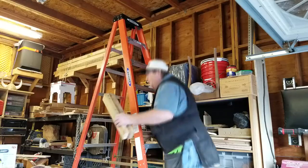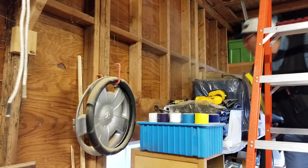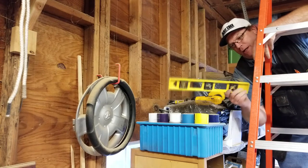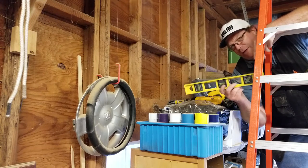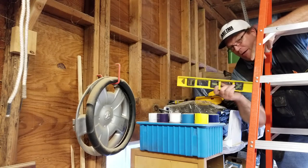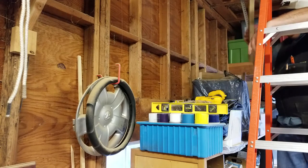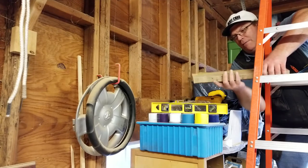Nothing like being 10 feet up off the ground — hopefully we won't fall. If you don't have one, go to the 99 cent store and get one of these levels. It works pretty good. One side I think sits level while the other side doesn't, so you get what you pay for. However, the beauty of using this is when you're doing something up high, I don't care if I drop it — if it breaks, oh well, 99 cents. Not like you paid 40 or 50 for one. And tip number two: pre-drill and countersink down below before you come up here. It'll make life a lot easier when you're trying to put the screw in.